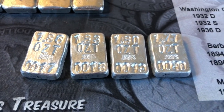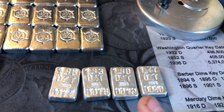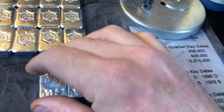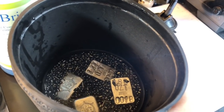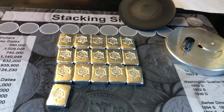Bars 17, 18, 19, and 20 are now stamped. I've got my tumbling mix here — a little bit of water and a one-pound jeweler's mix. I'll be adding about five or six drops of Shine Bright to it, then throw the bars in and put them on the tumbler for about an hour. If they have scratches I want to get out, it could take longer — up to four hours. These are pretty clean bars so they probably won't need much time. This tumbler is rated up to three pounds; with about three quarters of a pound of silver plus the water, I can do three or four of the bigger bars at a time, maybe five or six of the smaller ones.